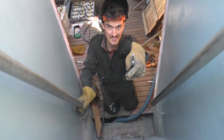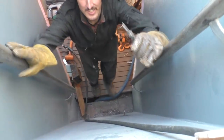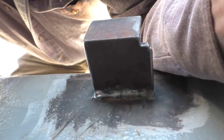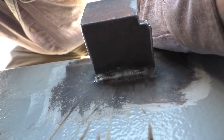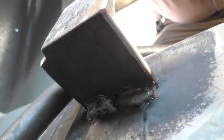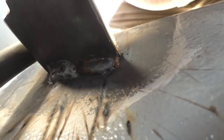First weld. Yeah, steel. Second weld. Third weld. But it's underneath. Oh, you got them done? Yeah, this one underneath. Is it pretty? It's pretty. You like it? That's not bad. Yeah, that's good. For your first MIG steel weld, it's because we're using CO2 gas and that doesn't help any. If we're using 70-30 mixed gas, mixed argon. Yeah, you're right. This one's not so great. Yeah, that's the first ever.